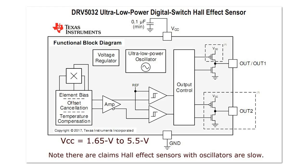Here is a blown-up block diagram of the DRV5032 Omni Hall-effect sensor. You'll notice that I have four connections: ground, Vcc — which is 1.65 to 5.5 volts. You'll also notice something very different on the outputs: we have a push-pull output, not just an open-drain MOSFET like in other ones. Some of these do come with open-drain, but most are a push-pull output.